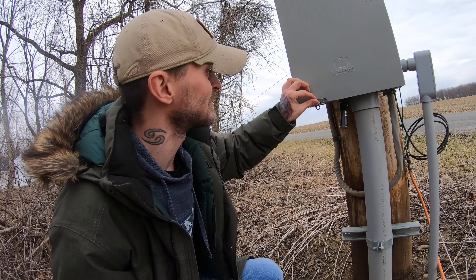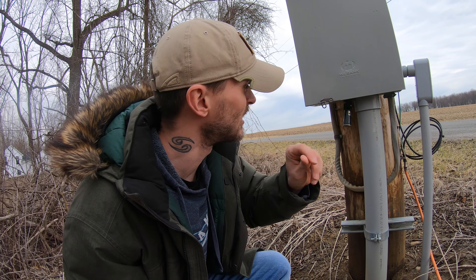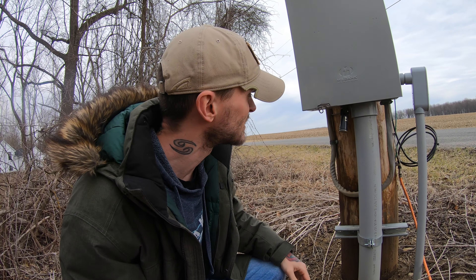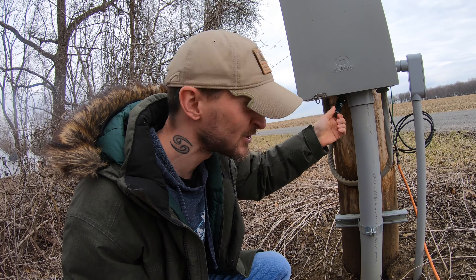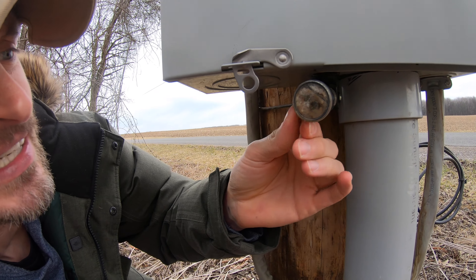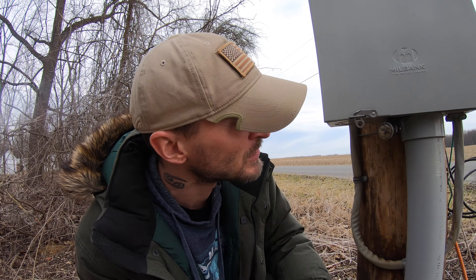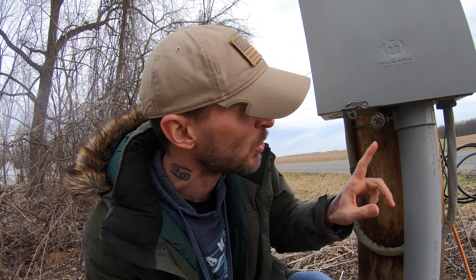All right, the lights are on — they should definitely be off. I've noticed it for about at least two weeks now and had to order a new one. I think the photo cell out here just failed, and it failed in the on position. I think it's the exact same kind, so all we have to do is shut the breaker off — there's three wires up in here, hopefully just pigtailed or wire nutted on, and we can disconnect it. Looks like there is a failure — that is pretty disgusting in there. If you can see all that gummed up mold and everything else. Maybe actually it hasn't just failed, but the photo cell is so dirty that right now it thinks it's nighttime because there's mold blocking the sensor.